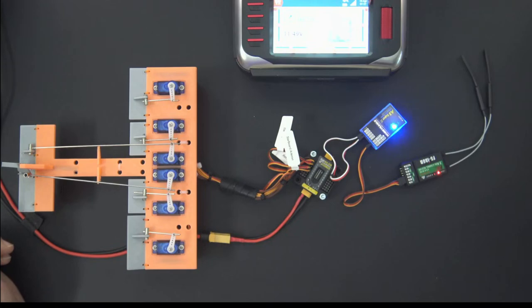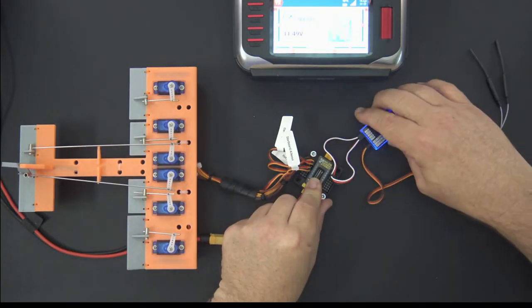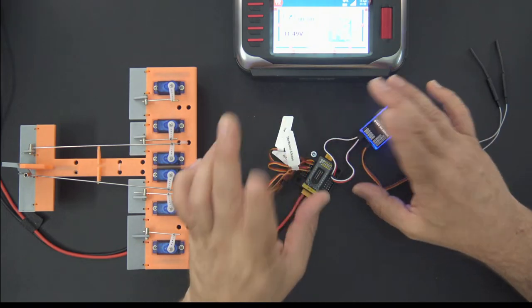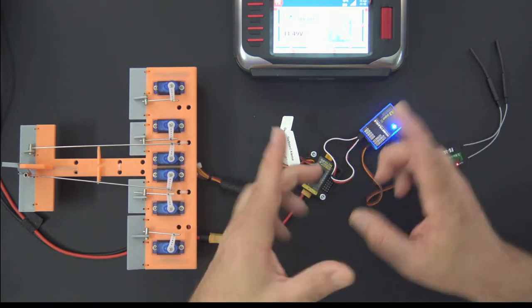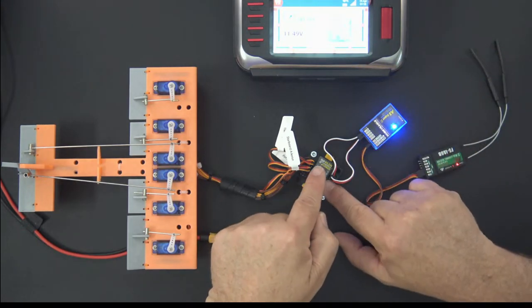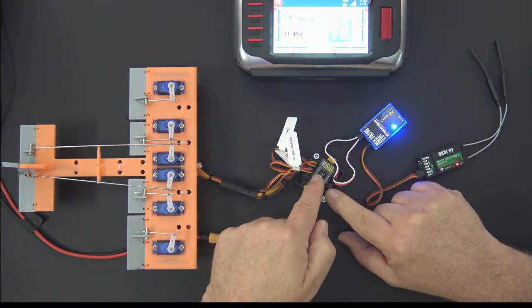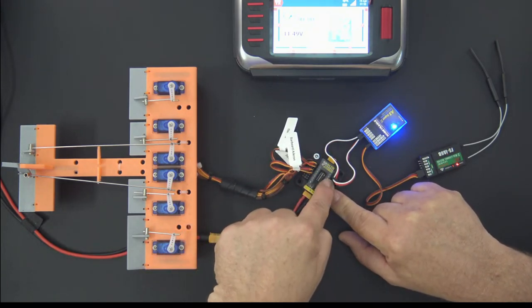Ken says, quick question. I'm guessing when you use the bridging, you need to not present multiple inputs from the RX. Yeah. So yeah, I mean, well, you can't. I mean, if you bridge these together, I just realized, based on that question, what a terrible example I gave. You really probably want the inputs to be on this side and the outputs to be on the other side if you're going to use bridging, because what it does is it connects this to the one lower below it.